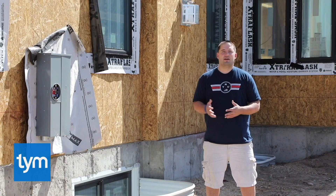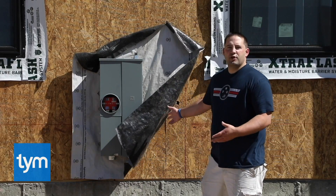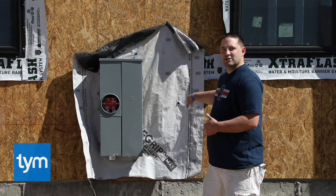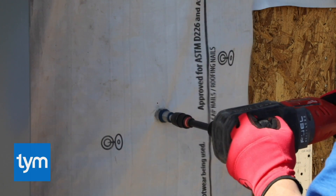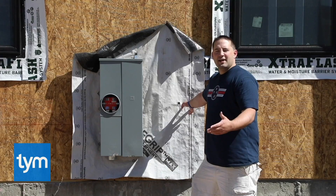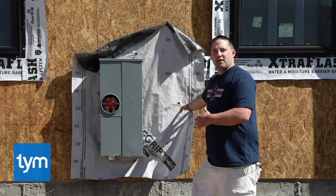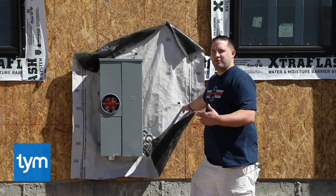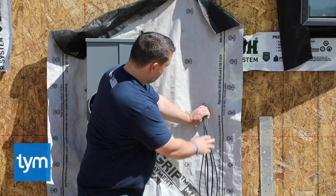There's a whole lot of stuff that we can run with the demarcation — I'll show you how we do it now. As you can tell, there's no conduit here at this meter. So what we're going to do is pull the wire out on the backside, closest to the back of the house. We're going to drill a hole right through the side of the home — I'm going to use a one-inch hole; if you need more wire, you can drill a bigger hole. It's okay to drill a hole right here, but we want to make sure there's nothing on the other side of the wall that we might hit. So check both sides before you drill. It doesn't matter if you go outside-in or inside-out — just drill your hole there and then pull the wires through.